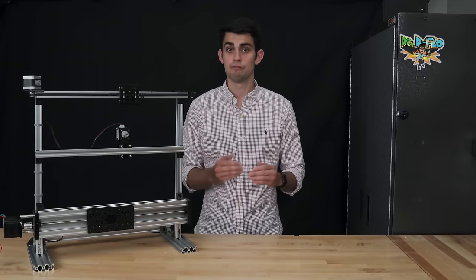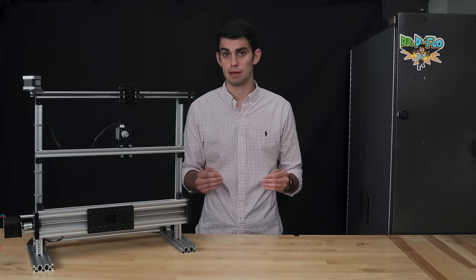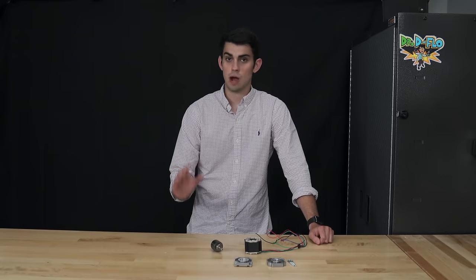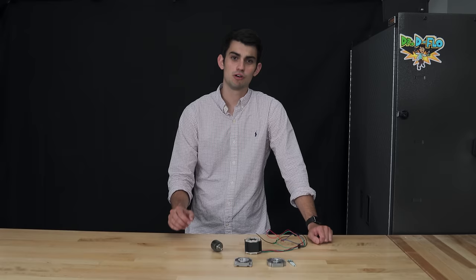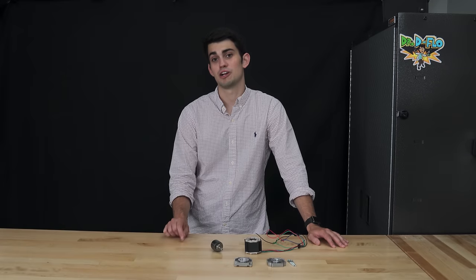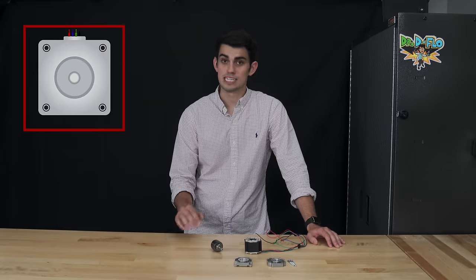I have to keep using the word full in front of step because stepper motors can take half steps or operate in even smaller increments known as microstepping. Microstepping will have its own section because it not only affects accuracy, but also the noise level of 3D printing. So how does the stepper motor move precisely 1.8 degrees per full step? Unfortunately, I'm gonna have to leave you hanging on this question because I'd have to explain even more stepper motor anatomy, most of which isn't critical information for learning how to operate or build a 3D printer. There are, however, a lot of great YouTube videos that address this question, and I will link to them below.